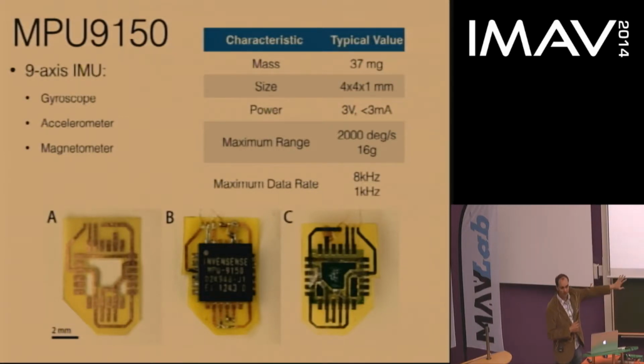A nice aspect of the magnetometer for the RoboBee is the RoboBee actually is driven by piezos, which have a very small amount of current going through them, basically no magnetic fields. So there's an interesting possibility that the magnetic field will be less disrupted by the RoboBee than in motor-driven aircraft. And in a previous work, we showed that we could use a magnetometer in a feedback loop mounted right next to the actuators on the RoboBee. But I won't talk about that here.